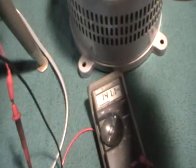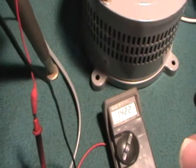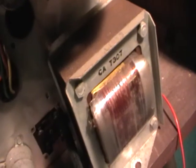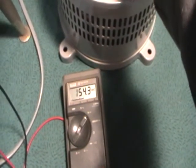Give it a bit more. Hello, I can hear things gapping there. I can hear the vertical output transformer oscillating, I can hear it buzzing. Yep, the vertical section's running. I can hear the transformer buzzing away. So that's what I was getting at, getting power of some sort. Time to up the ante. Increase the voltage and, as they say, tune for maximum smoke.